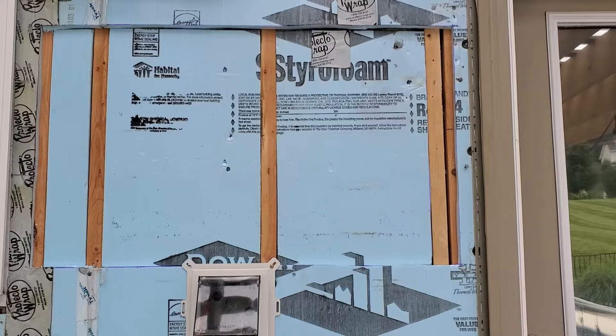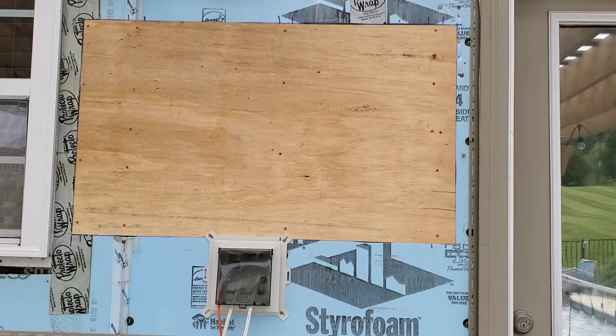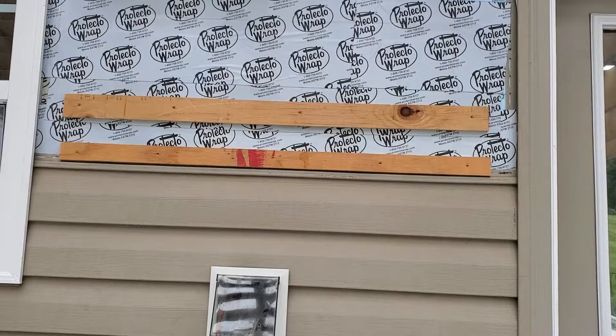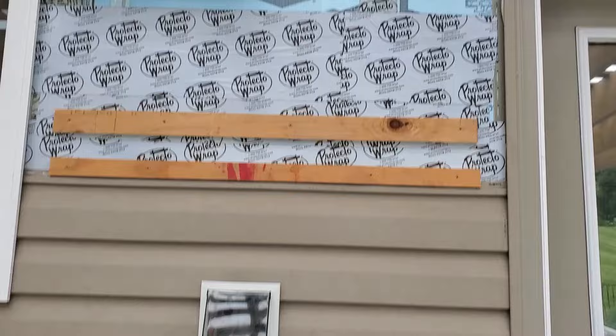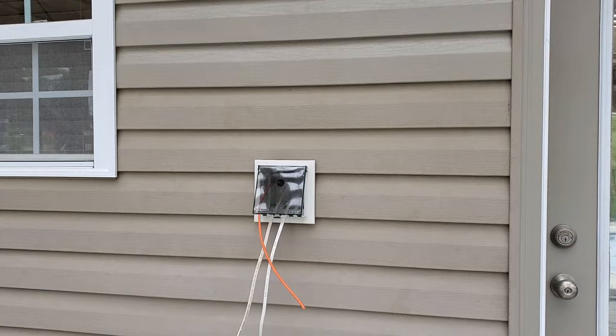Plywood's installed. Next I'll cover it up with protector wrap, go cut my ribs, and start hanging siding. That should give you an example of what I'm doing behind each piece of siding. It's my situation, not necessarily yours, but I cut an inch-and-three-quarter piece that sits right on top of the piece below where it snaps in, and then a two-and-a-half inch piece that fills the gap for the other section of double Dutch lap. We just keep going all the way up until we hit the top — that'll take up all the gap behind the siding so it doesn't crush when we cinch down our mounting fasteners for the Storm Shell.